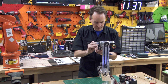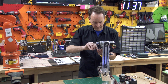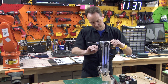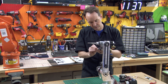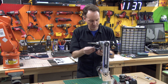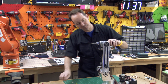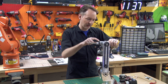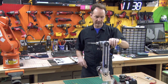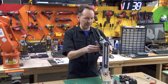So we got that in and we'll tighten this back down. And now you've got it — it's installed and it's not too bad. I was very concerned about the overhang on the belt, and the belt does overhang the pulley, but not a lot — not enough that it's going to matter. That's okay. And that's the J4 motor and belt and pulley and everything installed.